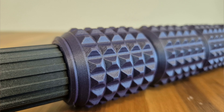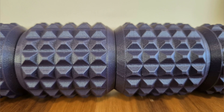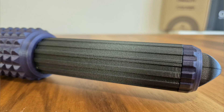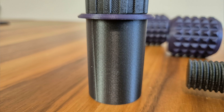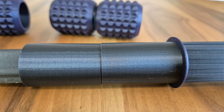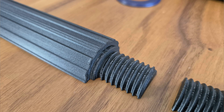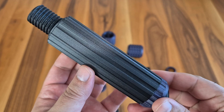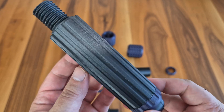All the printings were made very close to Creality's standard printing settings. I generally prefer to use speed in parts that are not visible, such as inner walls and inner infill, but the speed on the outer wall is not low either. When printing at speeds like 75 to 80 millimeters per second, the results are quite good. One of the features I like most about carbon fiber is that the layer lines are not very noticeable. Especially when looking at the black carbon fiber PETG, despite having a layer thickness of 0.2 mm, it looks as if the printing quality is even below 0.1 mm.